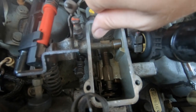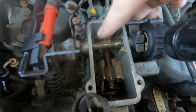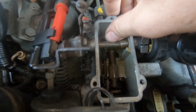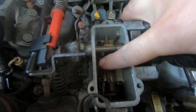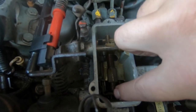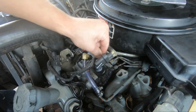It's the next morning and I had soaked this in Marvel Mystery Oil overnight and just got done sucking it out of the top. The linkage looks to be working pretty well. I initially thought the linkage was loose or something was wrong with the springs, but it seems to be moving fairly well. I think the fuel shutoff solenoid hook rides right on this little shelf and keeps this linkage tight against the plate. I'm putting some diesel back in here to top it off.